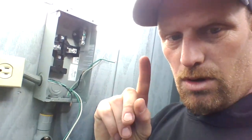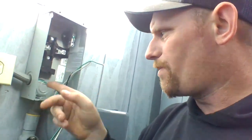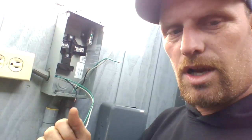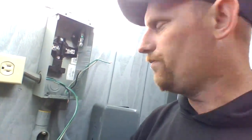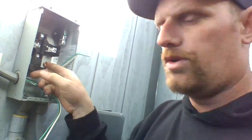You're either going to have one spot with a grounding screw that's going to bond both of them, or you're going to have a separate one somewhere else for a neutral. This one's small enough. I just made the whole thing a ground. If you don't have enough spots, listen to this carefully. If you don't have enough spots, wire up both of these together and then run one wire off of these into a slot up here. It'll still work. Same way with this too. Same thing. It's going to go into a breaker and these go up here.